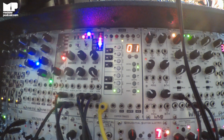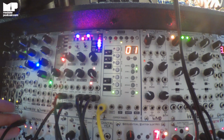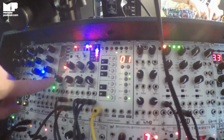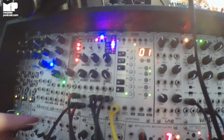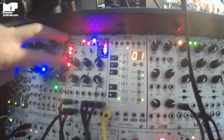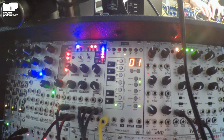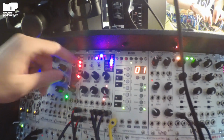Yeah, so I really love using it with the voltage block or a slow sequence, just like a DC voltage sequencer. And you can basically come up with chord progressions. And you can also, it becomes brilliant with the triad expander. I don't have it patched in, but basically you can use another lane of the voltage block or anything and basically tell it to change chord structure per bar or however often you want it to change chords. So you get like a second pad layer if you want it, chord layer on top of the arpeggiator.